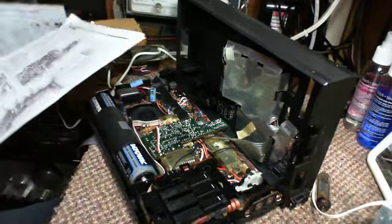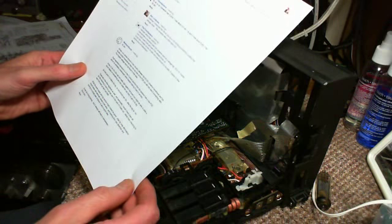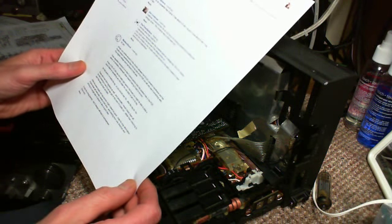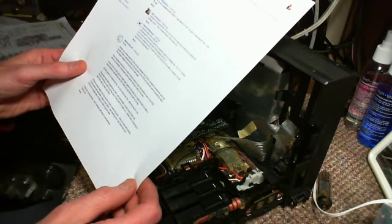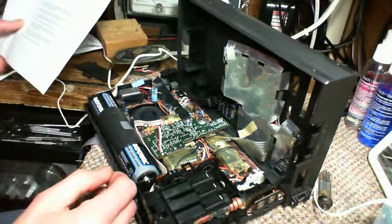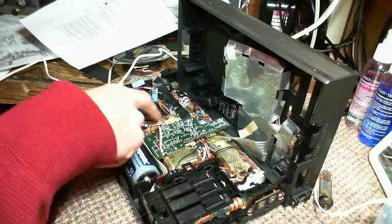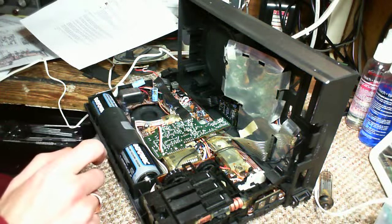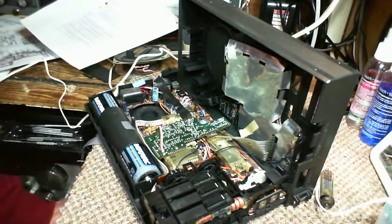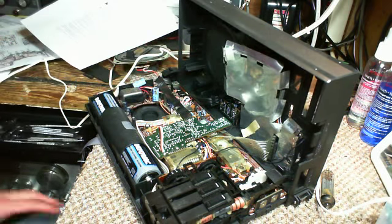So, now, let's see. The hint here is that the regulator transistor is in the 5 o'clock position from the speaker hole, which is probably underneath other boards, making it hard to access. Okay, so 5 o'clock puts it down in this area. Oh my gosh, I wasn't looking anywhere down there. I've been looking up in this area here and across the top, if I remember right, and looking under here a little bit.